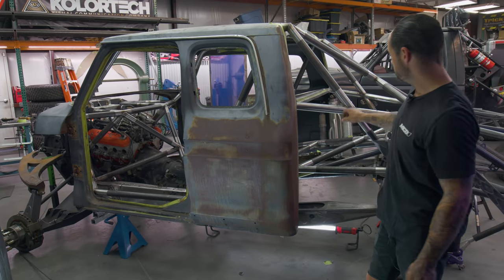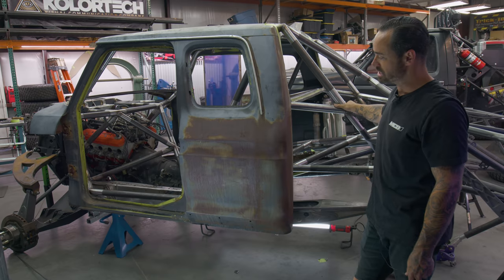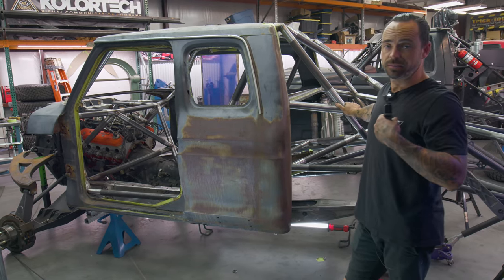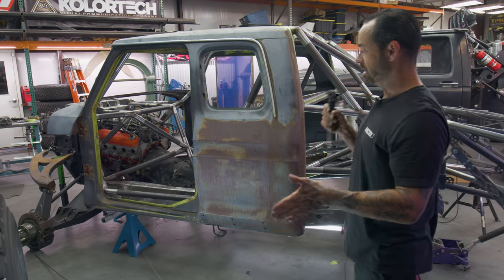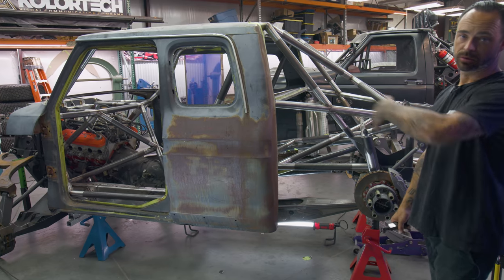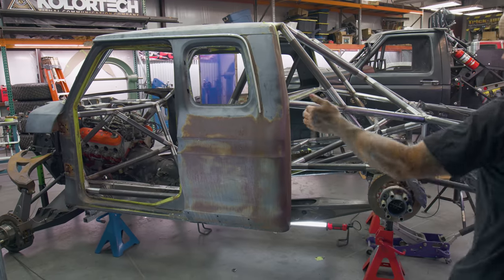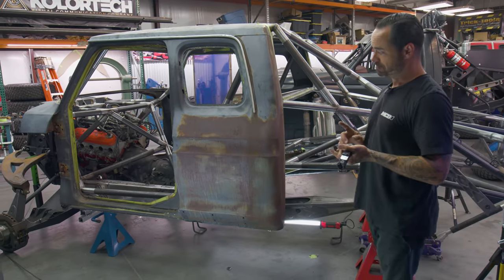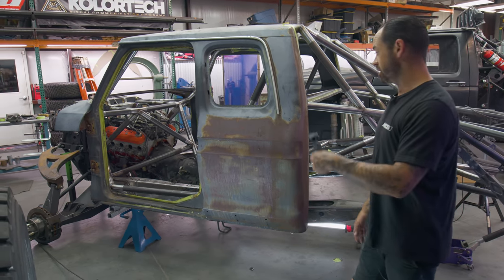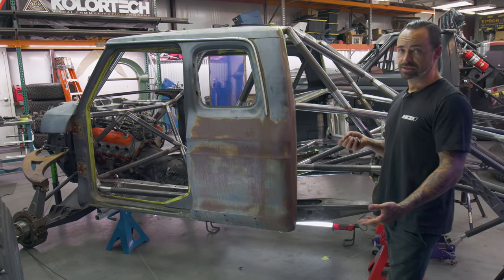So optimal wheelbase for, let's say, a trophy truck spec setup, where you want the thing to have the same handling characteristics as some kind of a spec truck or a trophy truck, is, in my opinion, like a 90 to 92.3 track width, 124, 126 inch wheelbase. So track width 90 to 93, and then wheelbase 124 to 126. A lot of luxury pre-runners or whatever are like a 135-ish, but a lot of them you'll see shortened to get closer and closer to that 124, 126.